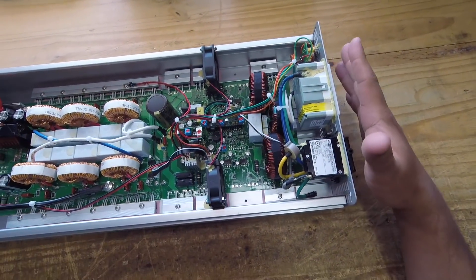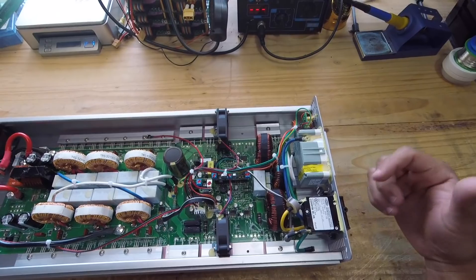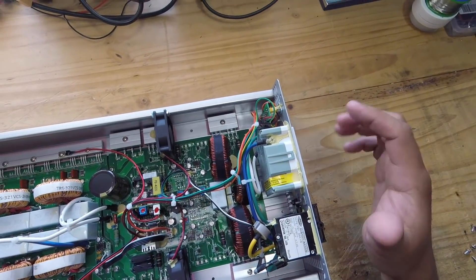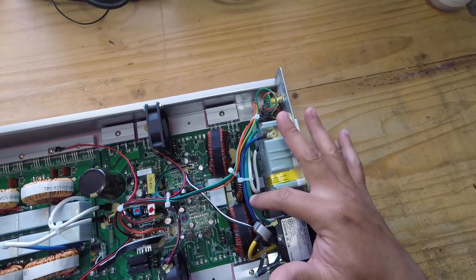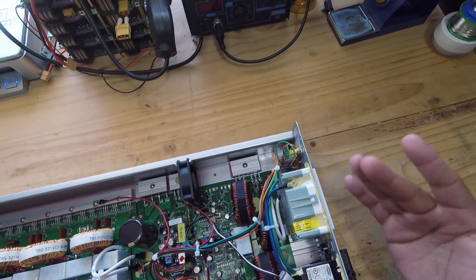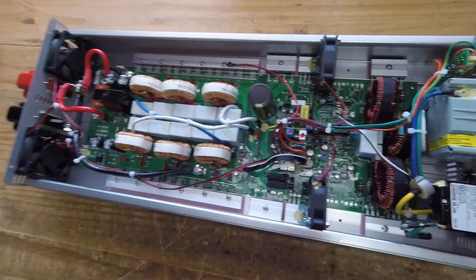I took it apart because to charge a Tesla you have to have a grounded outlet. The portable EVSE that comes with the Tesla checks for grounding, and if it's not detected it won't let the Tesla charge. On a portable device like this inverter, the way to trick the charger into thinking it's grounded is to connect the ground and neutral cables together. This isn't proper practice for house wiring, but in a contained, self-contained system it's not that dangerous. The main downside is that the GFCI likely won't function, but we're not using that system anyway.